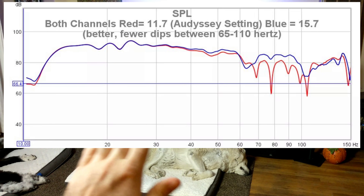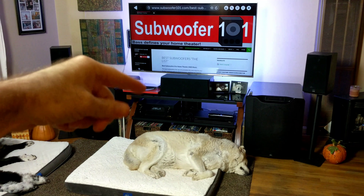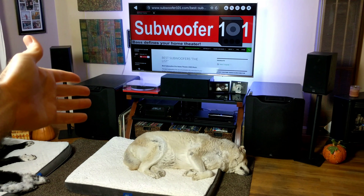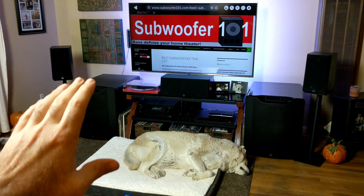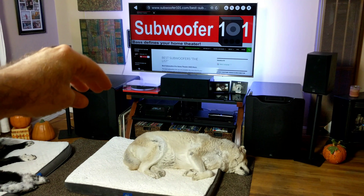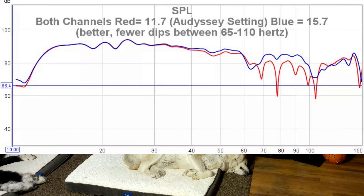For me, I've always found that adding four feet of distance to the subwoofers gives me the best response. What I'm doing is tricking the AVR — I measured at 11.7 but I'm telling it the sub moved four feet back to 15.7. By doing that, the amplifier says, okay, we've got to get that signal out to the subwoofer like three or four milliseconds sooner. What that does is populate the room a little bit more — I get fewer cancellations. It just gets that signal out a little sooner, and that's where I've had the best results on the graph. I can get a little bit better, but I don't like the sound as much.